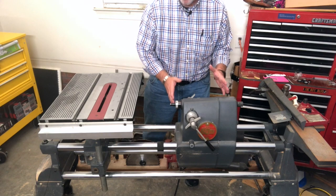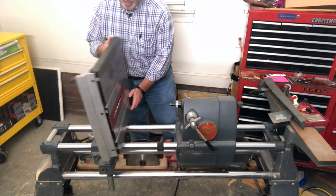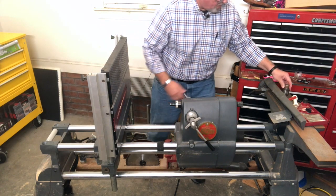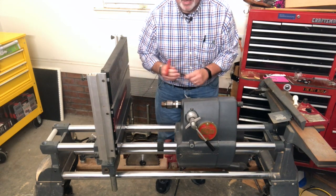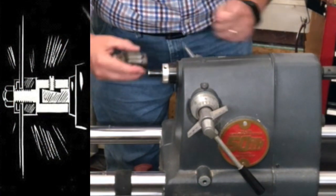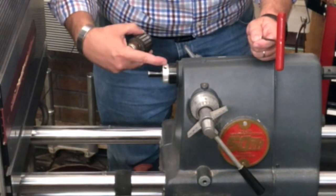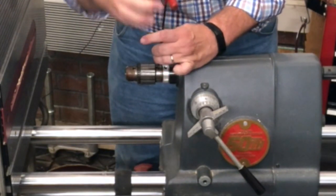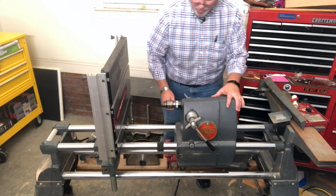Drill press tip number one. We want to position our headstock and our carriage where they need to be in drilling. We might as well go ahead and tilt our table 90 degrees, since that's typically where that's going to be. You'll get a sense of where to locate these after you've done some drilling. I go ahead and install my chuck onto the spindle, onto the quill at this point, and that also helps me judge how far away these parts should be. The set screw on the chuck goes onto a tapered flat on the spindle on the quill. That tapered flat should be in alignment with the set screw on this knurled ring. I'm going to go ahead and tighten that down using the Shopsmith toolbox, give it a little wiggle to make sure we're on tight. Then we do our five-point safety check.